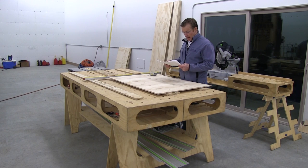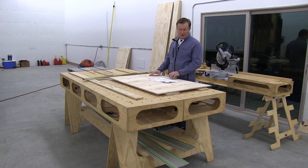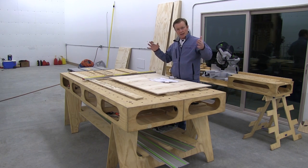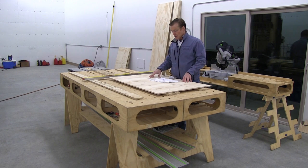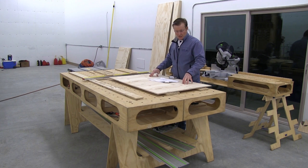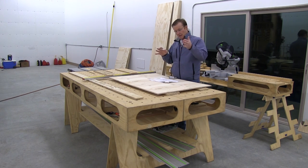The first thing I'm going to do is take the plans and lay out with a pencil, tape, and a straight edge — lay out the cuts I'll be making. The plywood I'm using for this is AC plywood. Some guys who've built the bench have used really pretty plywoods like Baltic birch or Russian birch. As I assemble the bench, I'll put the C side inward, so on the sawhorses it'll be on the inside. Since I'll be using this one as a template and cutting it out with saws and drills, I may not get it exactly perfect. So I'll lay out everything and cut it from the C side — if there are any overcuts or minor mistakes, they won't show as much because it'll be to the inside when the sawhorses are opened or closed.